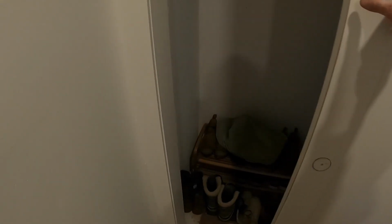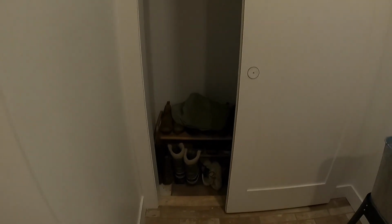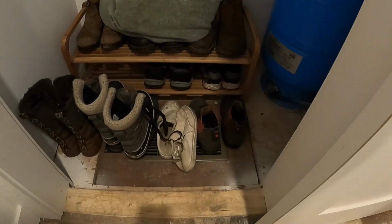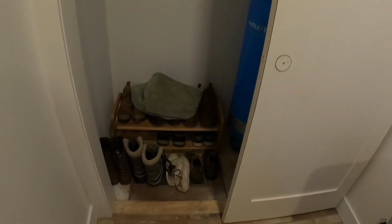Construction, hey, never ending. And so I'm about to build a little shoe shelf in here. It's going to need a removable bottom shelf, 15 inches off the floor. That's my hatch to the crawl space that you see down under there. This is all going to be painted probably this evening. So two 15-inch slots, one under the shelf, one above it. Then we're going a 12-inch, a 12-inch, an 8-inch, an 8-inch, and it'll leave me about 16 inches before I bump into those pipes. It's going to be 14 inches out from the back wall, and it's, for the most part, going to be live edge.